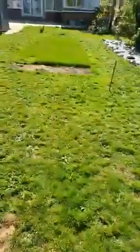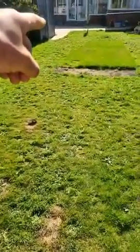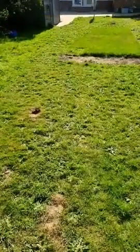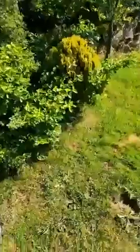The reason we're going the full 20 metres up here - we're not going to patch around this. We're going to go from the patio all the way through. Because our grass is going to be better than that, and it's sitting high with different levels. What we should be doing in this size garden is coming off the patio and rolling this with high pressure rollers and wacker plates, getting this flat - what we call worktop lawns.